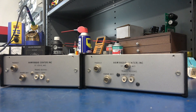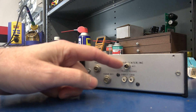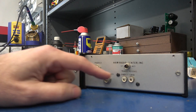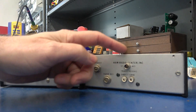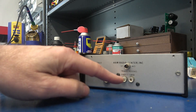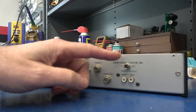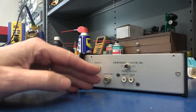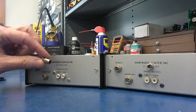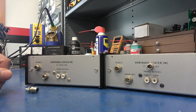The first step of the installation is to add an RCA jack. You get your direct and grid key outputs, but you need to add the KEYALL output. You can reconfigure one of these, but I elect to add one so I still have the full functionality of the keyer box. I'm going to be adding this little chassis mount RCA to the rear of this unit.